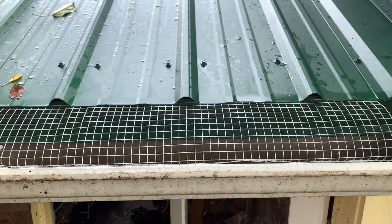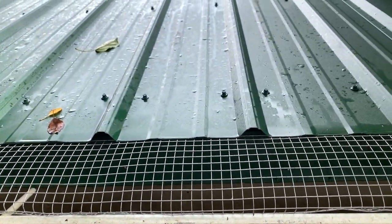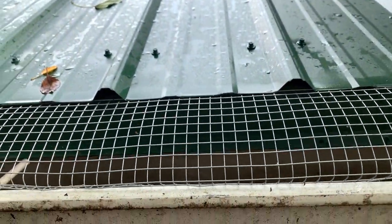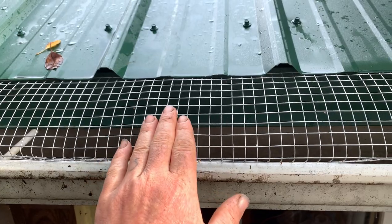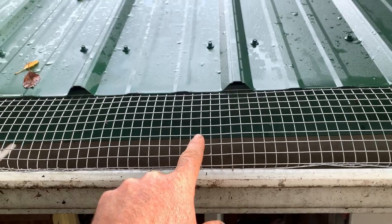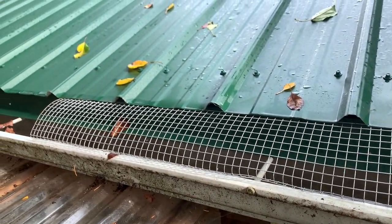This is the very first fit, and I'm pretty happy with the basic idea. It's a rough sketch, let's call it that. But with the pitch of this roof, I should be able to shed most larger leaves. If I wanted really fine filtration, I could probably go for a quarter-inch or eighth-inch screen, but I don't have that right now. And at this size, even a lot of material coming in should still be able to flush through the downspout.